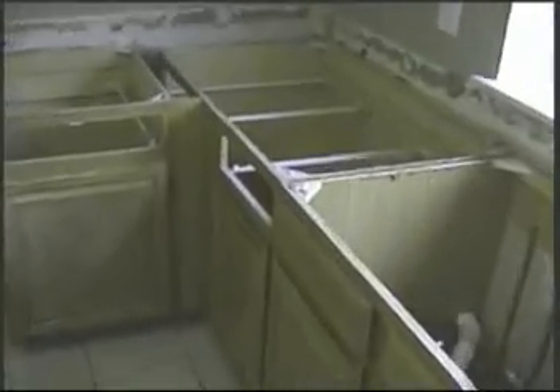We're starting to remove the counters, the drawers, the drawer slides, and the doors. Once all the doors, drawers, and tops are taken off, we'll start to sand the face frames with 80-grit sandpaper. This will give you a better view of the inside of the cabinet. The storage in the corner area is going to be removed and replaced with new cabinetry.